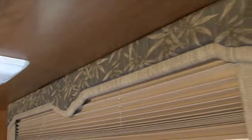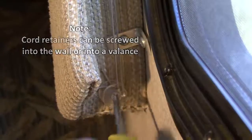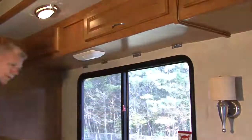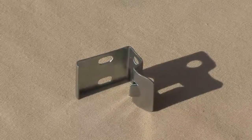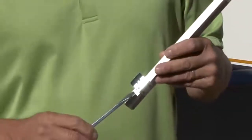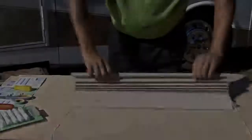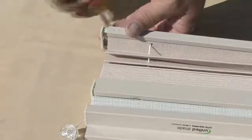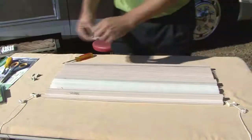The first step is to remove the shade from the window. Start by removing the screws from the cord retainers at the bottom of the window. Next, remove the shade from the window. Some shades use a quick install option, meaning the shade's top rail has holes in it and is screwed in — if this is the case, remove the screws. Other shades have brackets; to unclip them, place a flat head screwdriver between the bracket and the head rail and apply some pressure to separate the bracket from the head rail. Place the shade on a dry, clean, flat surface, and carefully pry loose the end caps using a flat head screwdriver, avoiding damage to the plastic cap. Set these parts aside for reassembly later.